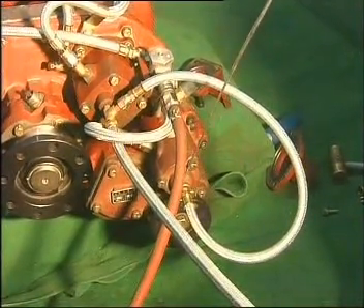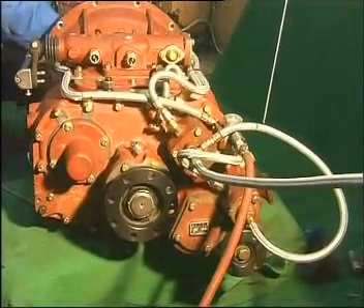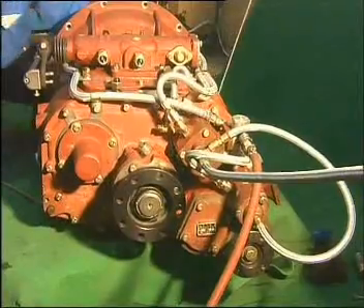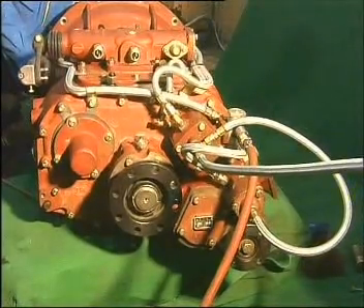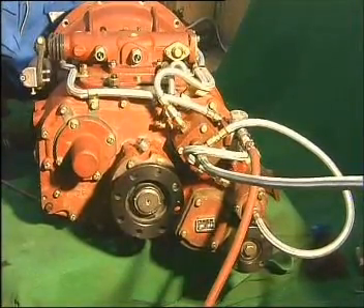After the air goes through, the auxiliary case is at the next position. The PTO is ready to engage; the air pressure is about 0.7 to 0.8 MPa. According to the specific situation, shift the controlling lever to the required position and the PTO starts to work.